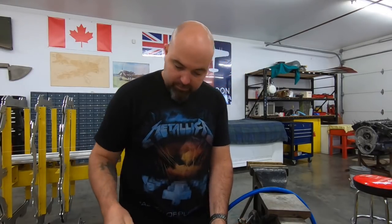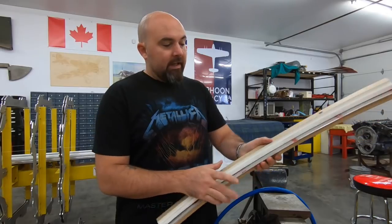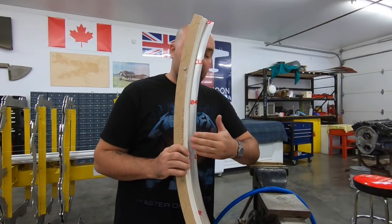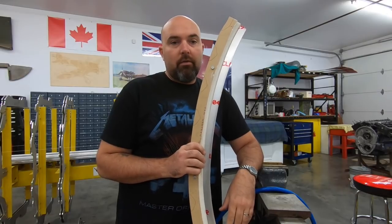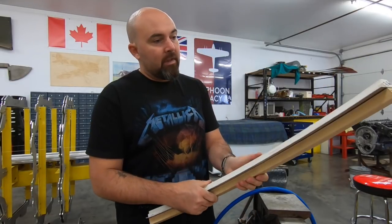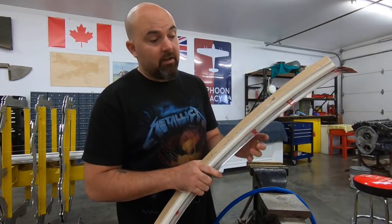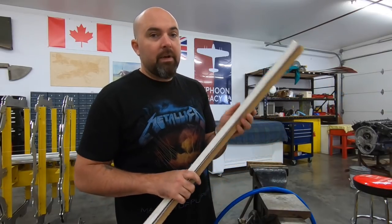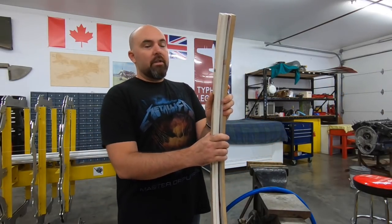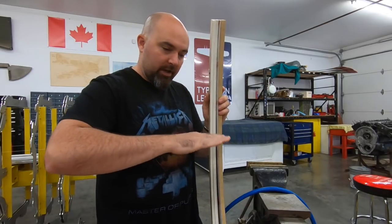Put these back together using the same pins and the same tooling holes — everything works quite well. This flange has extra meat on it that'll have to be trimmed down, which makes it a little bit trickier when we start. These smaller flanges towards the back of the aircraft are getting pretty small, so just have to go a little easier. This is one of those cases where I was talking about knocking the flange over slowly for that shrink flange and slowly bringing it down.